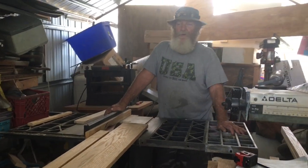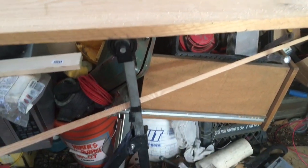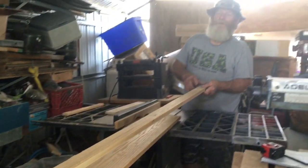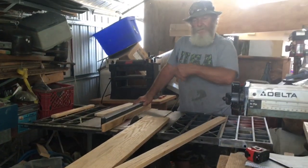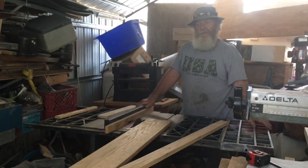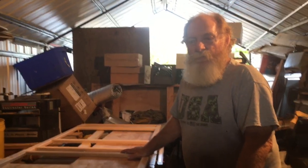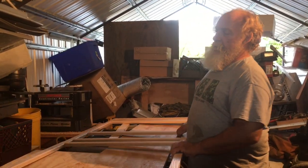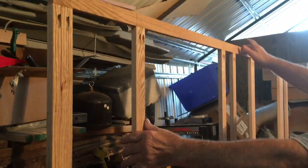That's pretty much how you make your smaller boards. You put a roller out front because this is way too heavy and you don't want it to tip down out front. The roller right there catches everything as it rolls out. This is my two inch piece — I'll cut them down to 36 and then run everything through the planer. We're working on the face frame; I had everything cut and did all the pocket jig just like the last one.